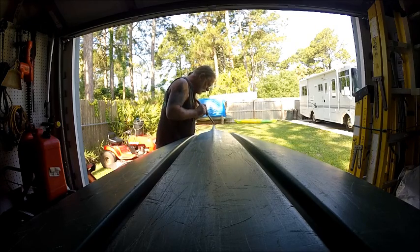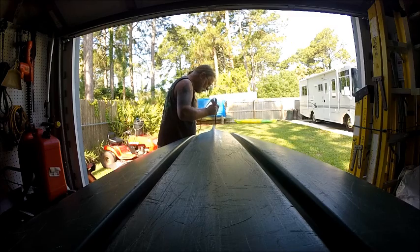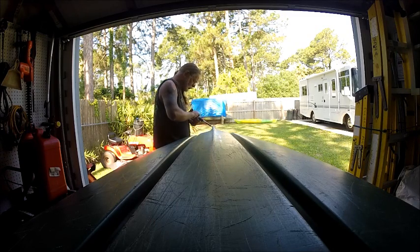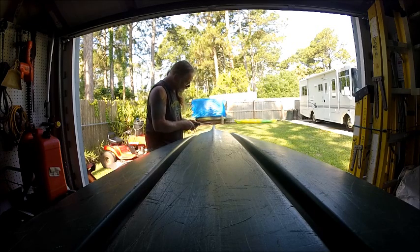Once I've got everything built up, to finish the repair, I'm using a really light touch and very slow movements with the welding iron to smooth the surfaces, and then blend the new material to the contour of the keel. Once I'm satisfied that it's filled and shaped appropriately, I grab the heat gun again and use it to melt out any ridges that were left by the welding iron.